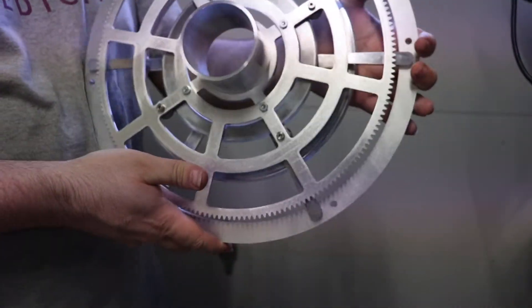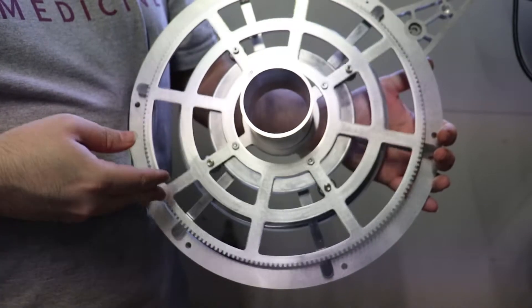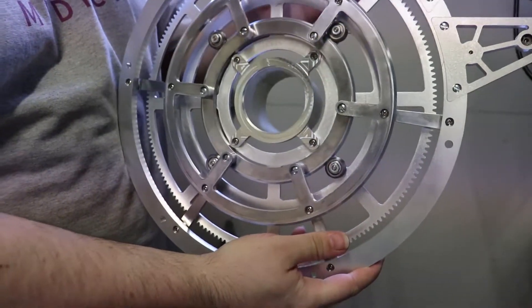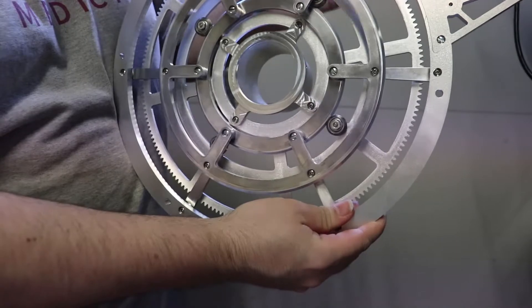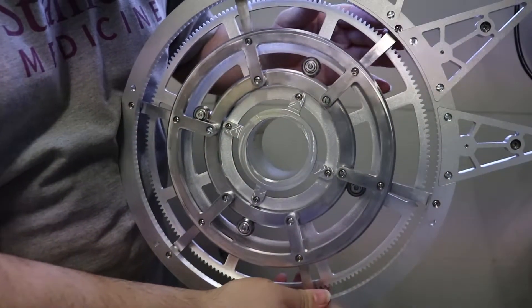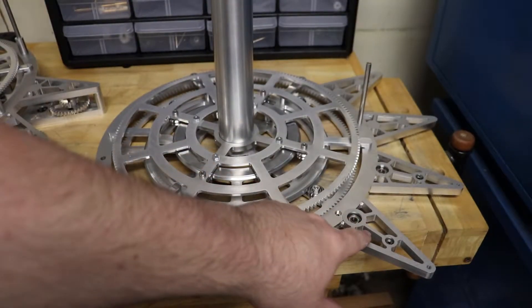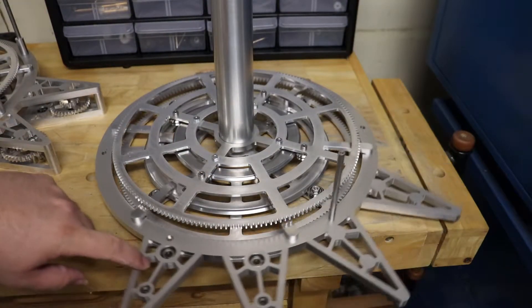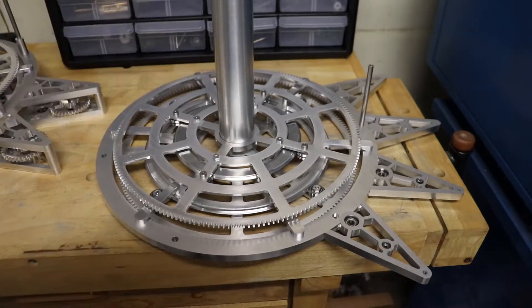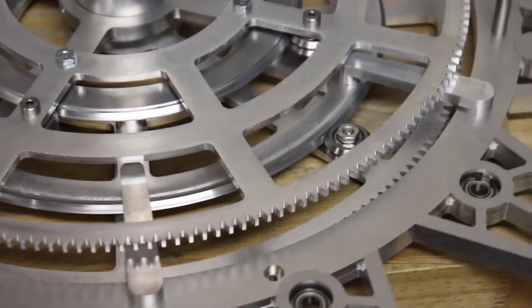It's hard to see how everything works when the orrery is fully assembled. Each large outer ring holds two gear tracks — a small one and a large one. The reason for the two different sizes is so I can vertically compress the two gears closer together. With two different sized tracks, I can have one gear above and one gear below, with the supporting bearings for those gears sharing some vertical space. These bearings are v-groove ball bearings. Here is the ring assembly with two gears attached. Notice the bottom gear is resting against the desk so that I can rotate the rest of the assembly instead of the actual gear. Here's a close-up shot of the v-groove bearings in action.